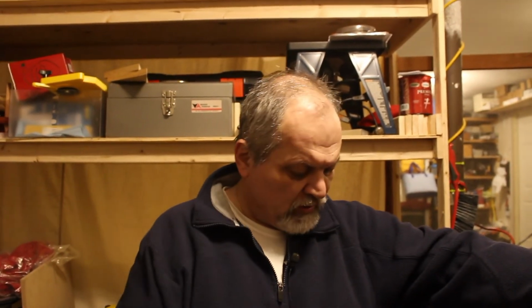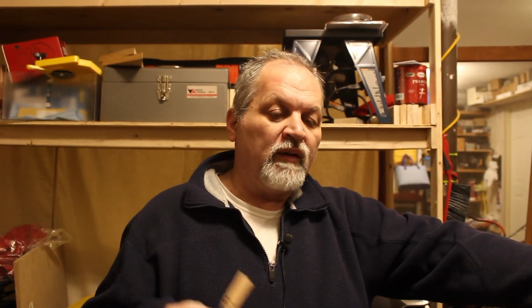under the conditions today, we did not want not to have a video out for you, and sometimes there's not much we can do. Showing you how to square boards is boring. We show you how to do one. The same methodology will be used in all of them, right? We'll definitely show you how to make the boards, how to edge them and plane them. It's called a thickness planer for a reason. We'll decide on a thickness, and every board will go through the thickness planer, right? To hit that thickness. That will make the flat surface for the desk. And it will minimize our sanding. It will not eliminate it, but it will definitely minimize it, right?